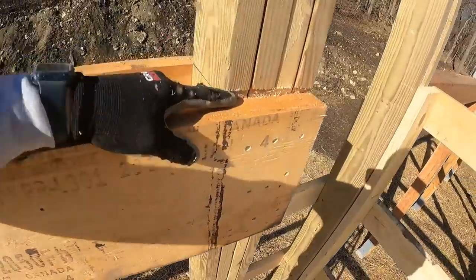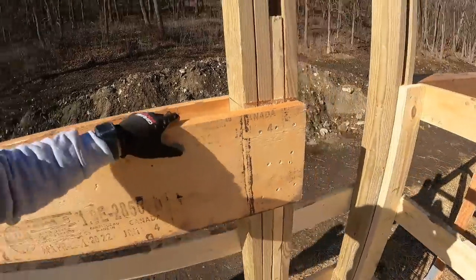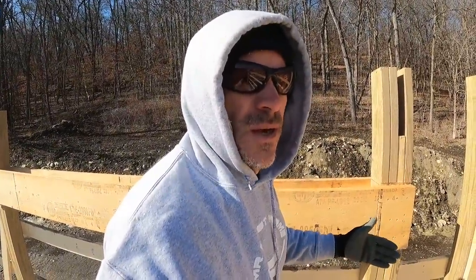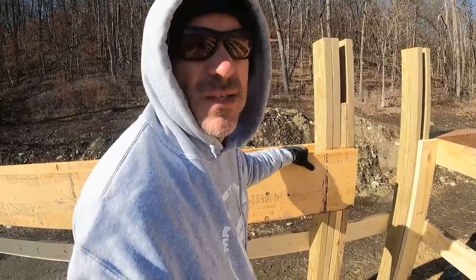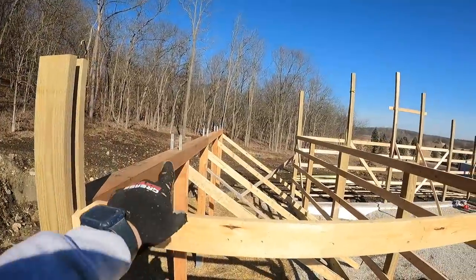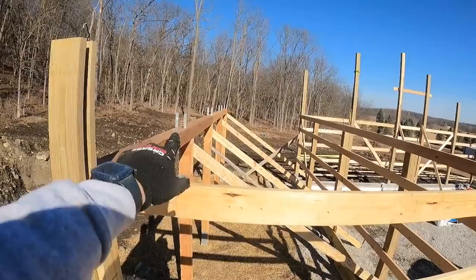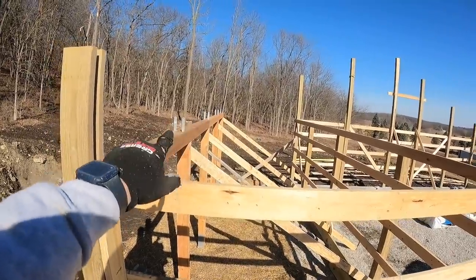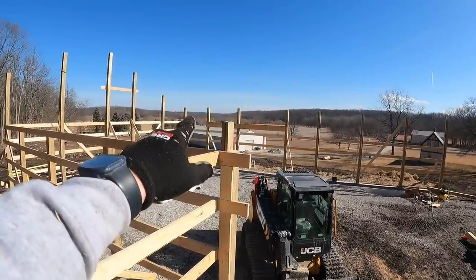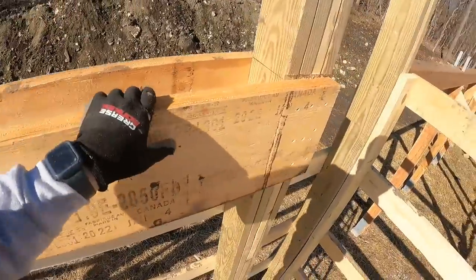the columns. We had to notch it 1/4 inch because this house is getting interior 2x4 girts. So that will match the 2x lumber. These LVLs are actually 1 3/4 inches. We also got all my first set of truss ties screwed into the 6x6. So we're all ready to go there. We got that double LVL all ready to go. I got my truss locations marked there. We'll wait to mark this one until we get closer.